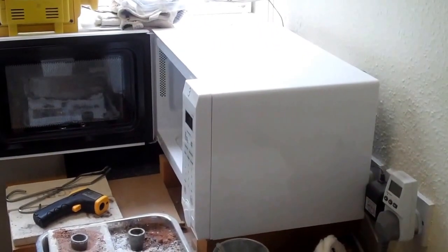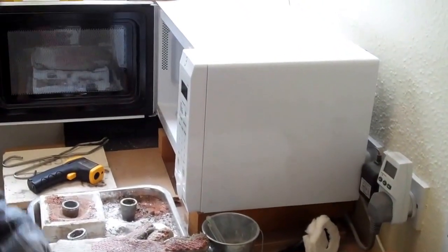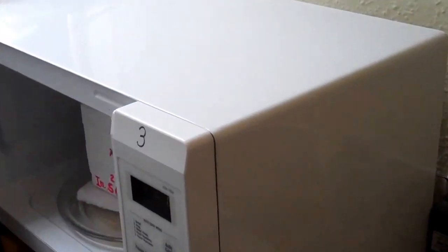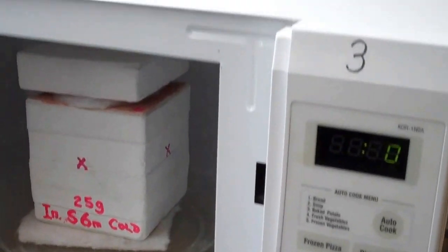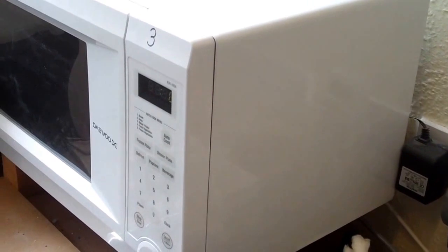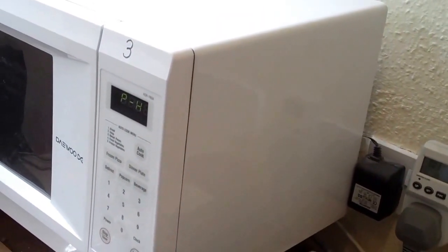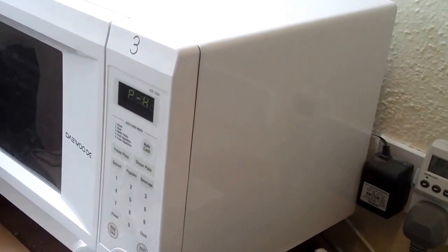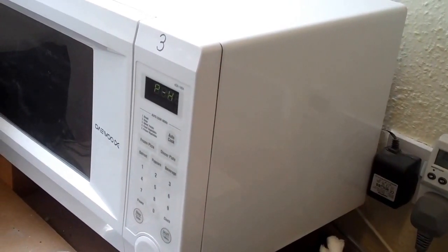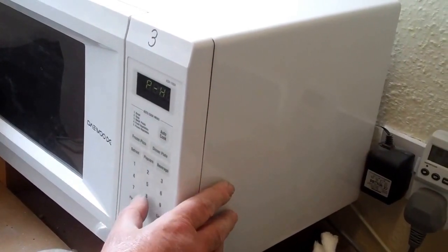The microwave is just a bog-standard, low-end domestic microwave rated at 1000 watts. We stand the furnace on another super wool blanket on the rotating plate. We hit it at full power — we're looking for a shorter melt time, not only for convenience but the shorter the time, the less the material spends oxidizing. So we're on full power and we're going to dial in eight minutes.